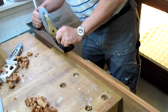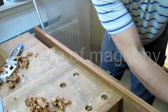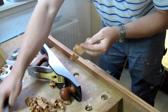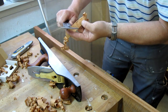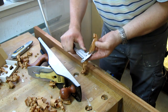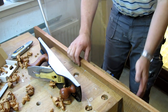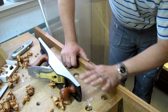This is still out of the box, just as it left the factory. And there you are — nice shavings. Food board with almost see-through shavings. The least I can measure is 0.05 millimeters, or two thousandths of an inch. That's okay for a factory blade. A little honing on the water stones would create an even better edge. Even as-is, this is leaving a fairly smooth, nice surface.